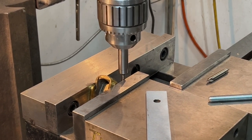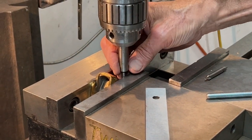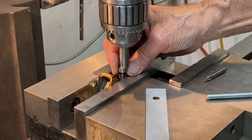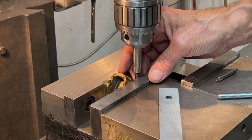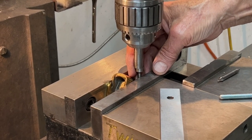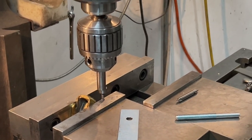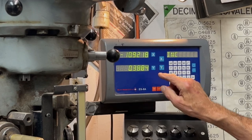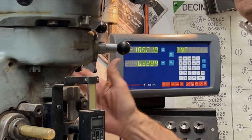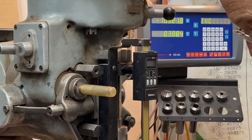And the other side, this is called an edge finder, so it's a clever little device that I've explained before, but anyway, when it touches the edge, it slides along, it runs along the edge like that and lets you know where it is. So we're going to ask the readout to divide by 2 and show us the center of the part by magic. All right.